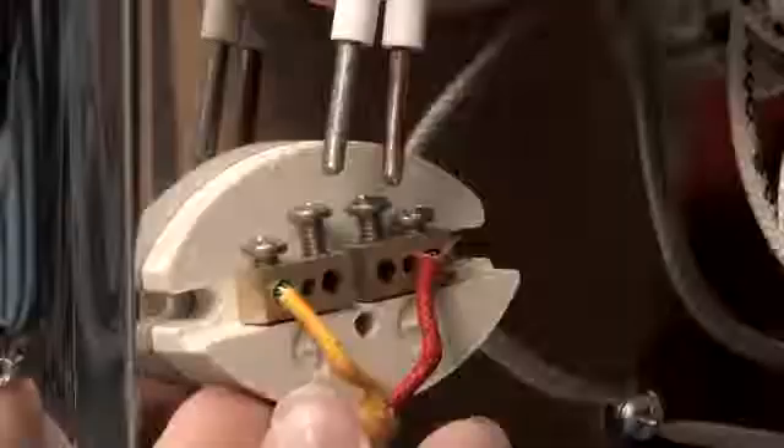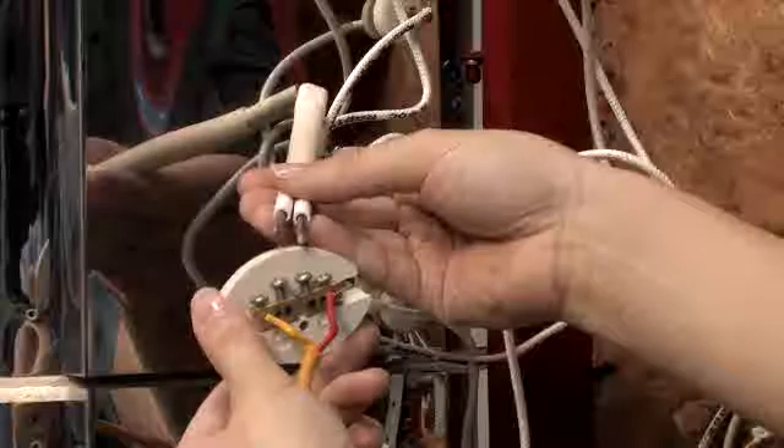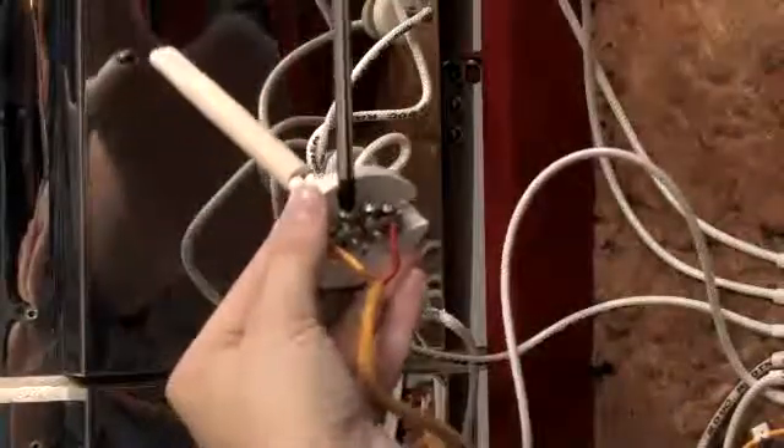Unlike your car battery, the negative side of your thermocouple is marked red. When you are inserting the replacement thermocouple into the block, make sure that the red leg of the thermocouple is in line with the red thermocouple wire coming out the opposite end of the block. Tighten the set screws.